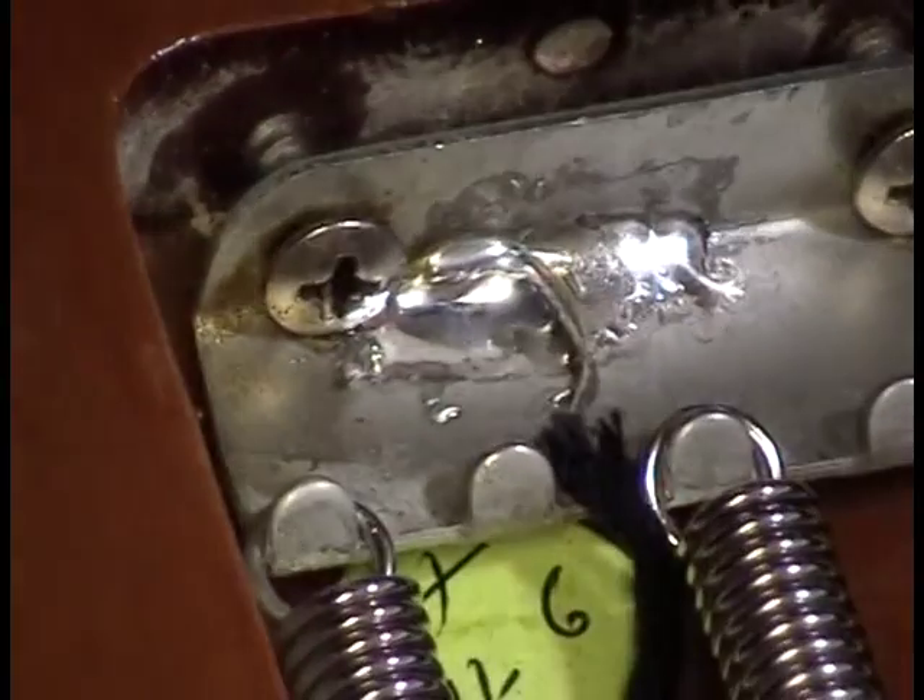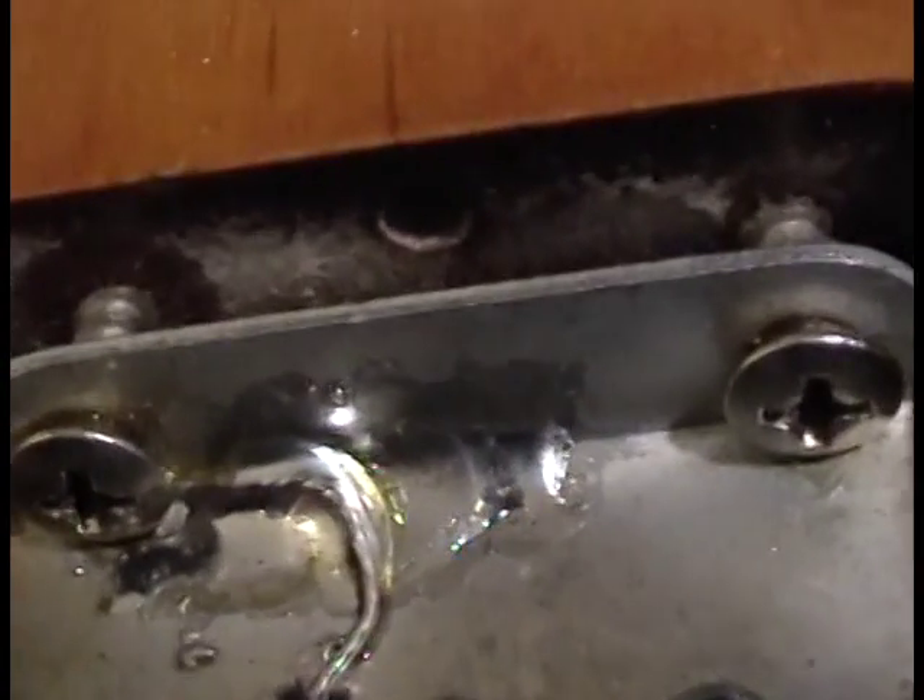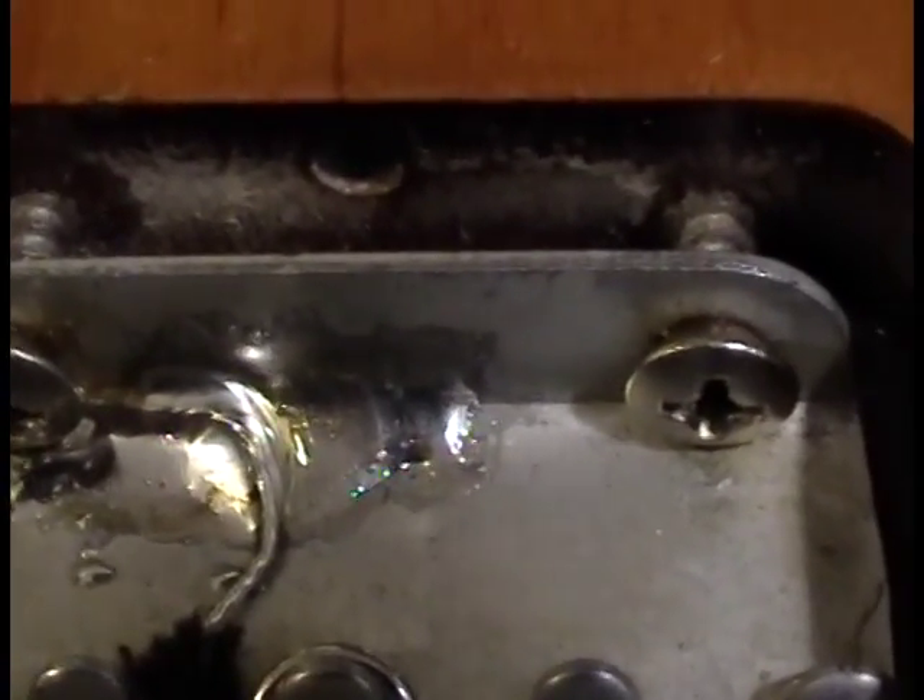You see that? Let me get you a better look. It's actually much better done than it's showing up on the tape — it's just an odd angle. All this stuff here is old solder, but that right there is the new joint. Look at that beautiful joint — see how nicely it's all flowed out. No big huge globs. So when we do this for real on the other video, we're going to clean this up really well before we start. I just wanted to let you see what the thermal capacity on that JBC iron is.